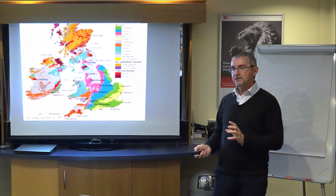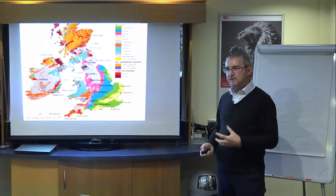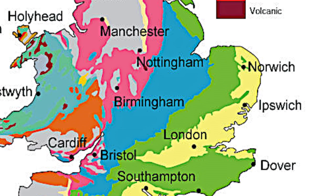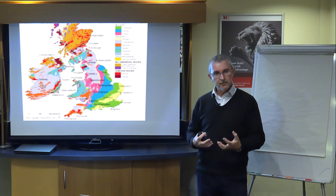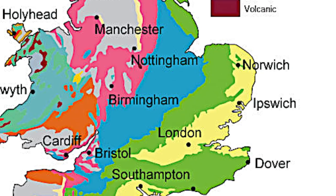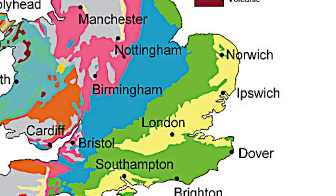Right. So in this country, the limes and the limestones, chalks, this sort of thing, primarily are down the eastern parts of the country. When you go towards the central and northern, and certainly towards the west, geology gives us much harder stones, and they're not suitable for creating mortars and limes out of. So the areas that we're focusing on about being able to get the limestone and chalks out are primarily down the eastern side and the central parts. And these chemically are all what we now would call non-hydraulic lime. We don't have any sources of hydraulic limes in this country.